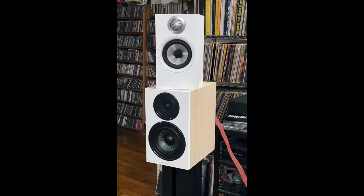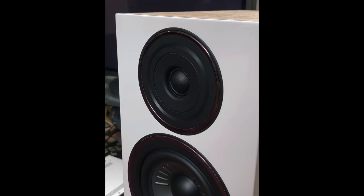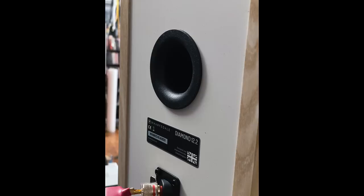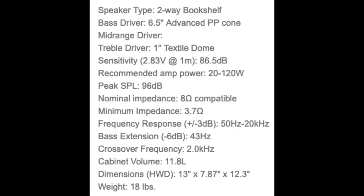The 12.2 is obviously a two-way speaker with a six-and-a-half-inch woofer and a one-inch textile soft dome tweeter, rear ported. I'll put all the specs on screen for your perusal. But to me it's all about sound quality, and it's kind of hard to nail down because it's a pretty neutral sounding speaker — nothing jumps out. It's not bright, definitely not bright. Bass is very satisfying and the midrange seems very neutral.